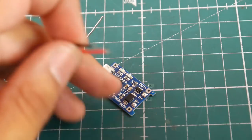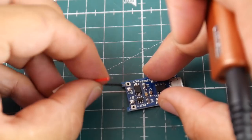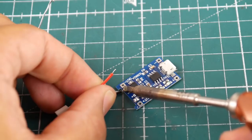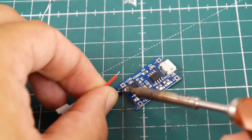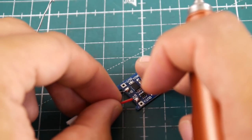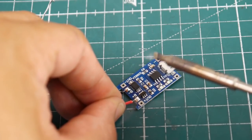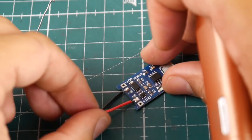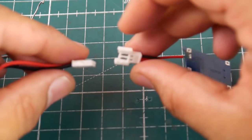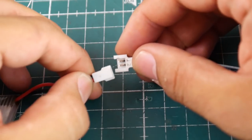Clean the tip — very important. The minus is the black wire, which is ground. Let's go ahead and do that. There we go. Now we're going to do the positive side — make sure you don't bridge the pads. There we go, that's in and very nice.